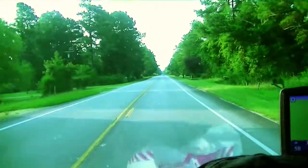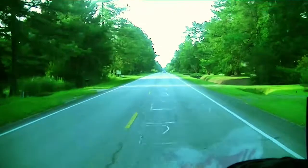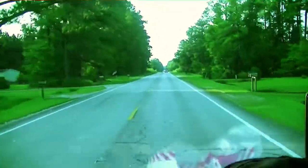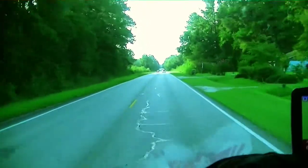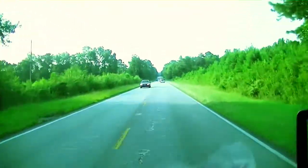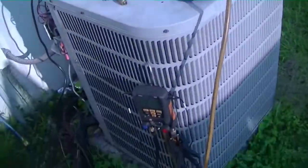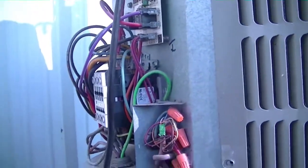Because the evaporator leaks pretty badly, we're going to remove the rest of the refrigerant in the system if there's any at all, and separate the system inside and out with the service valves, pressure check it, and just put the mega ohm meter on it and things like that. Just to make sure they're not going to replace an evaporator and have an awful condenser outside. We're recovering the refrigerant out of this Goodman slash ICP that R.E. Michael has. We already checked the compressor with the mega ohm meter — it was fine.